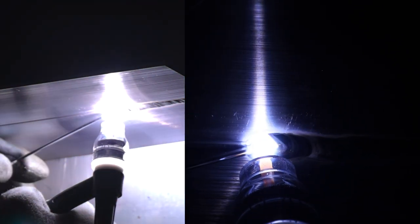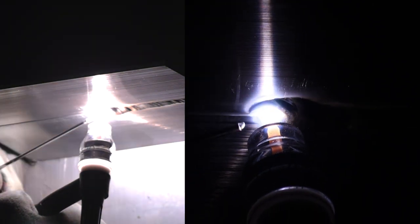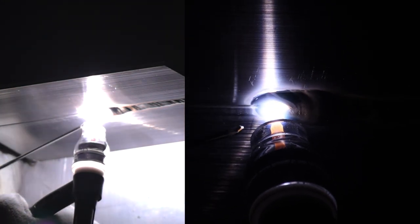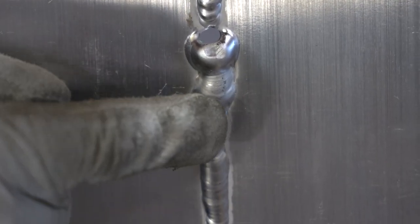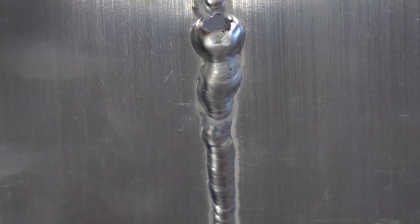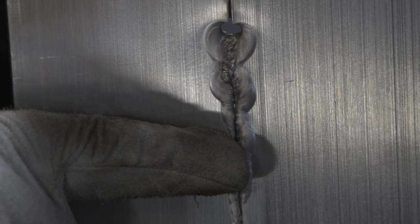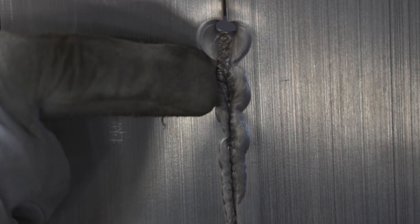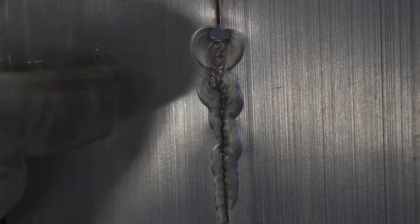The only thing that's a little more difficult about overhead than flat is that your limit of 'I'm too hot' is just a little more narrow with overhead, because all your heat's rising up. So when it starts to keyhole, you have to really get on adding filler rod or your puddle's going to start sagging out — it gets super high and starts kind of sucking back. Then once it blows out, you're pretty much done. You're going to have to stop and let it cool off before you can start trying to fill that hole in. You can see we started the second run about here — getting hotter, getting hotter. Right here is pretty good, and then I stopped adding filler rod and it started to fall out on me — that's when it all went bad.